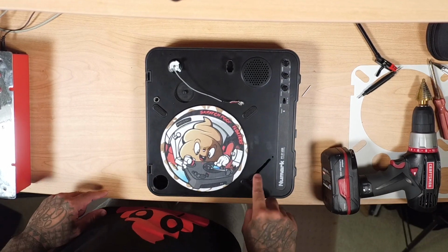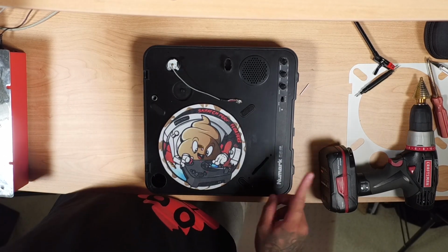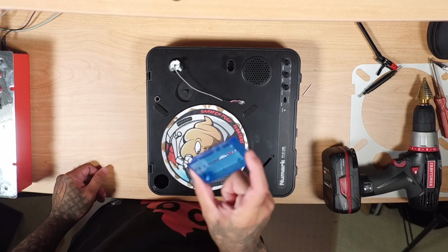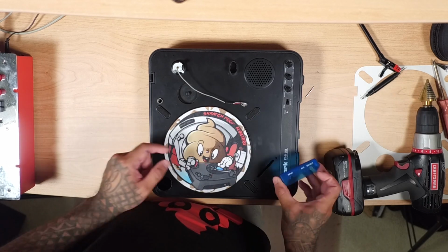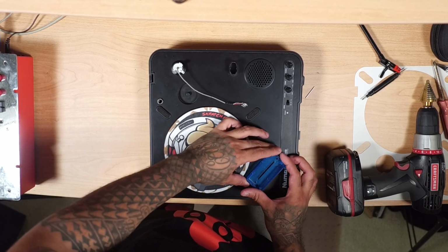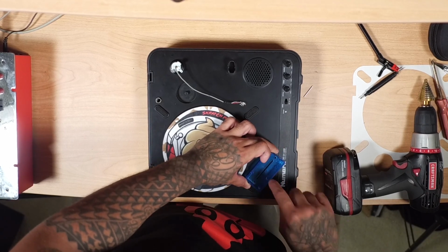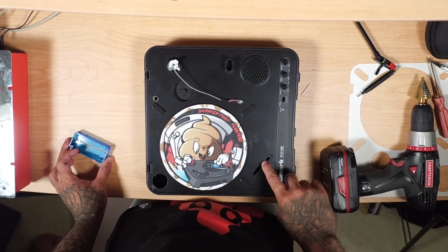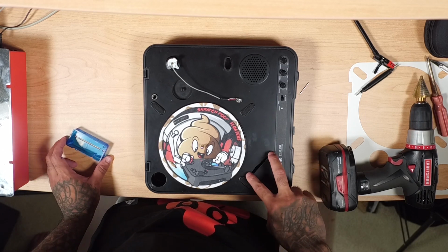To get this fader line cut good, this is how I usually do it. I did not cut this right here though. You want to use the stock casing from the Jesse Dean fader, and just place it right where you want your fader to be. And just flip it upside down, get a pencil, outline where the screw holes are and where the fader line is. And then from there, you take a Dremel, cut the line, and take your drill and drill 2 holes for the fader.